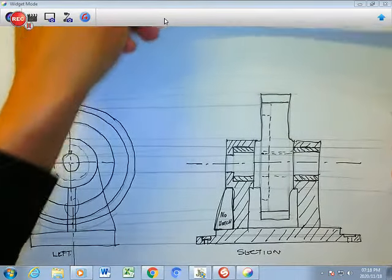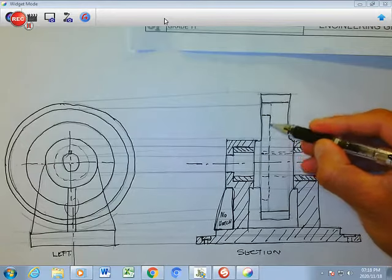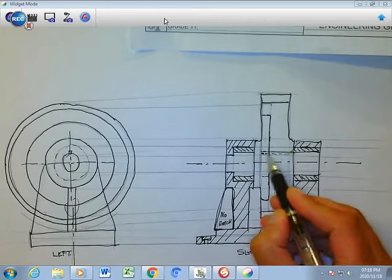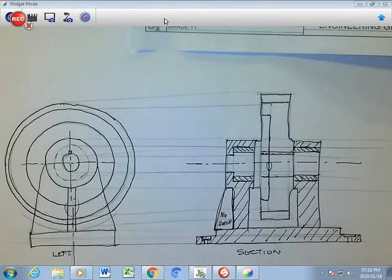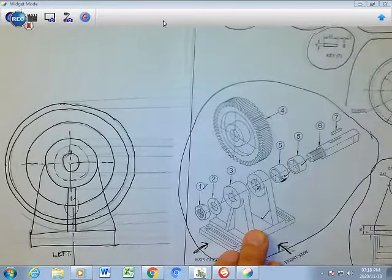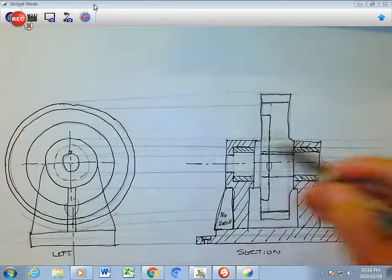What I need to also do is that I need to convert the dashed lines here to solid lines, because that is going to become solid once I cut that. This section is going to fall away because that becomes empty now. That's a hole that runs right through. That here is the teeth of the pulley, which is not shown like it is shown on here. It's actually just the distance of the crest, which is the depth of the teeth, which is shown there.